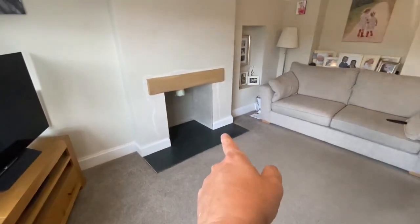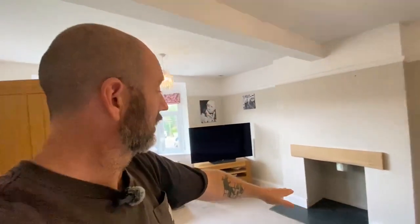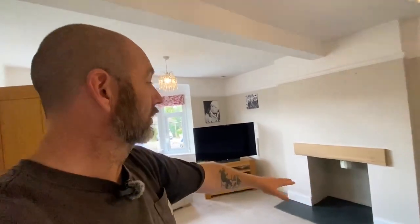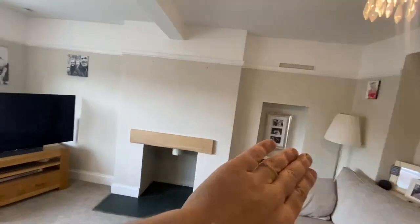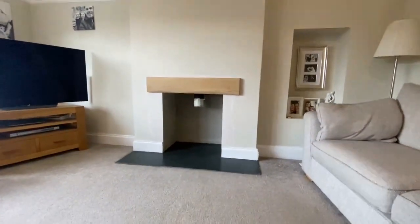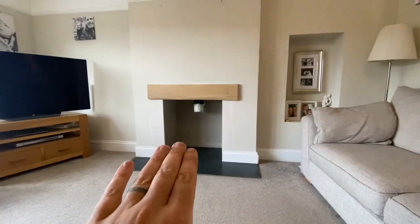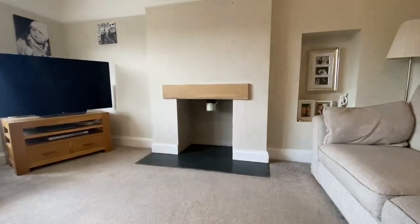Unfortunately, the skirting boards have got bits of wobbles on, but what do I do? You know, this whole opening across here is about 25 mil out of level, and I'm trying to cheat and make things work. And to make it worse, everything's twisted at different angles. If you know anything about this, when something's twisted, at certain perspectives it will look out of level when it's not.